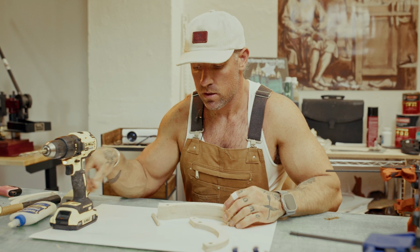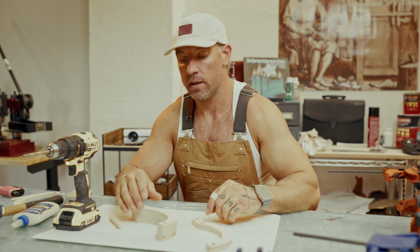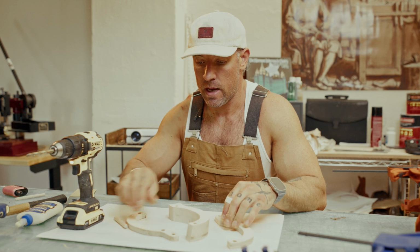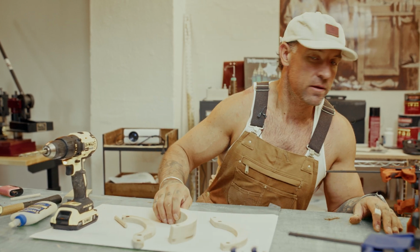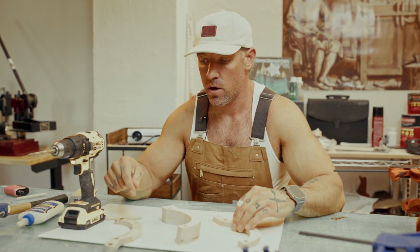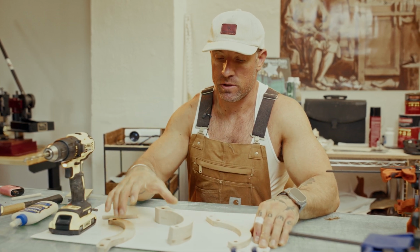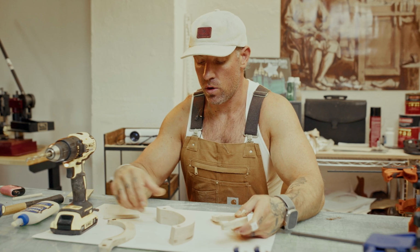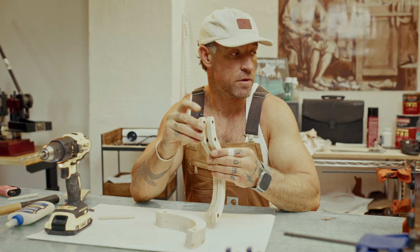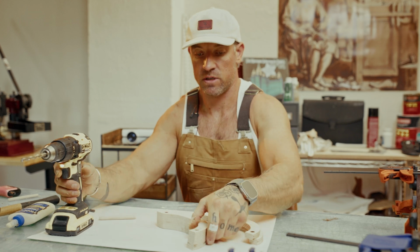All right, so because we're not doing this like a woodworker, we have to improvise a little bit. So these holes, once these 3 pieces are glued up, which are, let me remember, yeah, B1 and the Bs, so you have 4, 4, and then the 12. We're gonna have to just take our 3/8 inch bit and clean out the holes a little bit, because we wanna glue these 3 up together. The only one that we're gonna leave open is the bottom of the Bs, because that's where the hinge is gonna go. So we're gonna clean these out real quick.